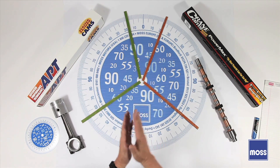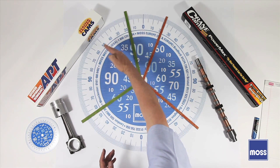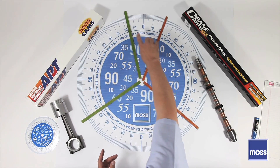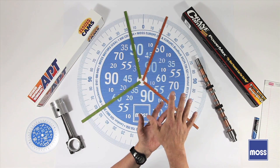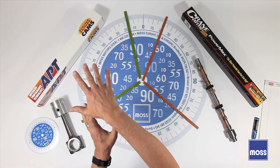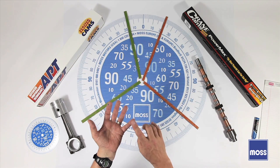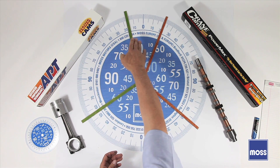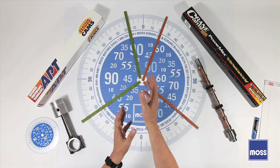Now, what are we going to do with that? Our exhaust valve is still open, we're getting ready to close it. The exhaust valve is beginning to close and it's only open a little bit, and the intake valve opens a little bit. Some of that pressurized air from behind the intake valve races in as soon as the valve begins to open. It runs across the top of the cylinder and it's cleaning in there. We still have a little bit of spent air and fuel in there we'd love to get rid of. So by having this come racing in before the exhaust valve finishes closing, we're flushing. This is referred to as scavenging.